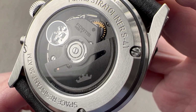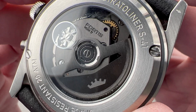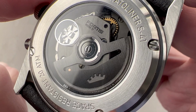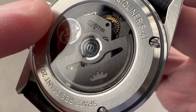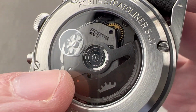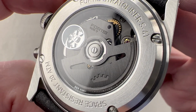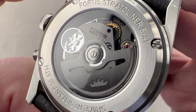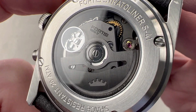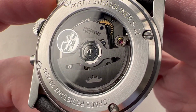Fundamentally, it's still an oscillating pinion chronograph, but the cam system is replaced by a true column wheel for crisper actuation. We have a smoked sapphire over the case back. They call this their spaceship or their space capsule viewport. We have satination and nickel anthracite across the bridges and plates, and then other elements are polished. The movement, which is a unidirectional automatic winder, has a 60-hour power reserve, which is a substantial upgrade from the 42 to 48 you find on a standard 7750. The column wheel, which is both aesthetically attractive and a pleasure to operate, is also an upscale refinement.